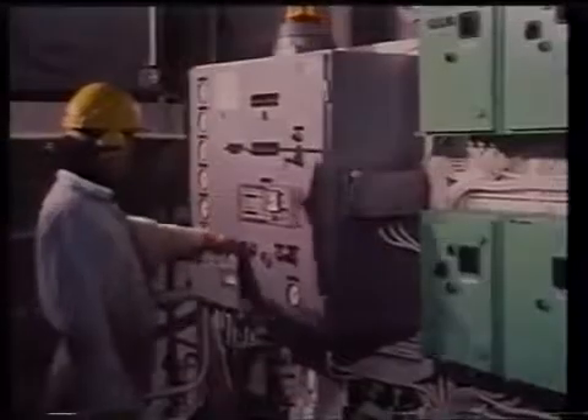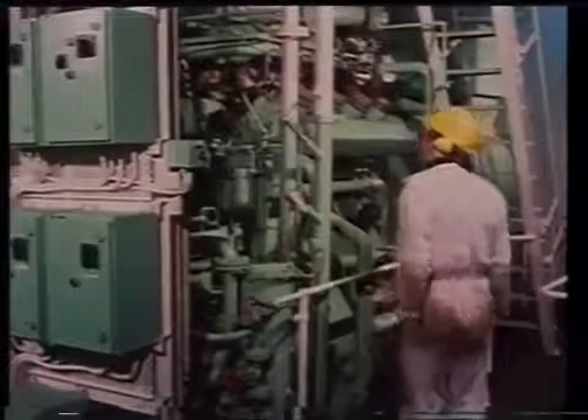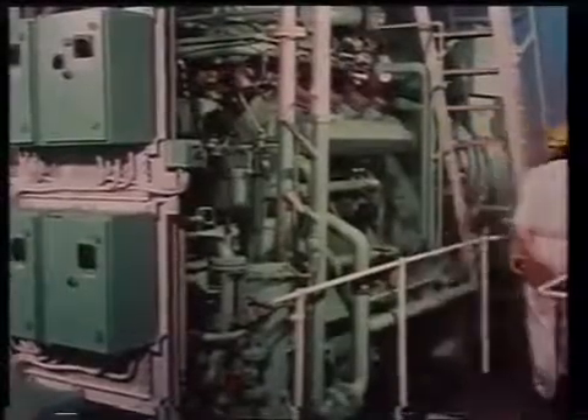Test the automatic start-up system for the emergency AC generator, ensuring that the system is operational within the regulation 45 seconds after a mains failure. Connect the emergency AC generator to the switchboard with a load, such as the motor for a firefighting pump.